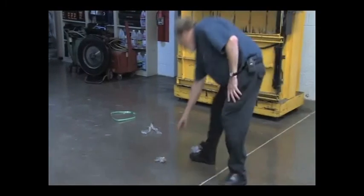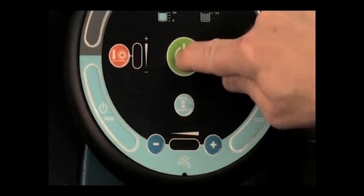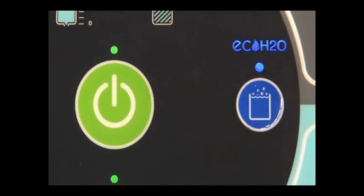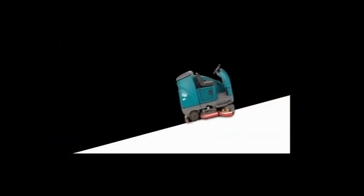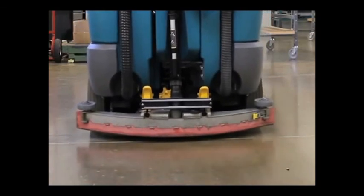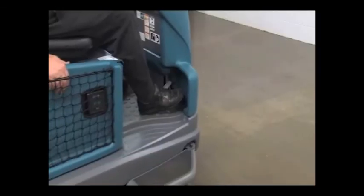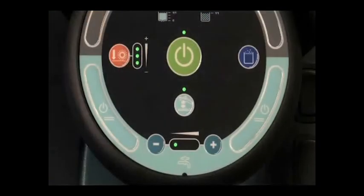Cleaning with your machine. Before scrubbing, manually pick up oversized debris, wire, string, twine or any other debris that could become wrapped around or tangled in the brushes. Press the one-step scrub button to start scrubbing. If necessary, set the scrub mode and settings for the area being cleaned, then press the propel pedal to begin scrubbing. For safety, drive slowly on inclines and slippery surfaces. When operating in reverse, the rear squeegee will raise to prevent damage. When traveling forward again, all scrubbing systems will turn back on. To stop the machine, release the propel pedal and press the brake pedal. As the machine stops, the scrubbing systems will stop and will begin again when you resume propelling. To stop scrubbing, press the one-step scrub button — the light next to the button will go off and all scrubbing functions will stop after a short delay.